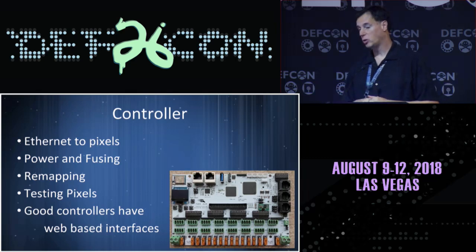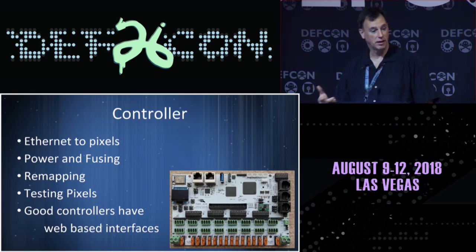Along the bottom, the gold-yellow things are auto fuses. So each of the pixel strings is fused. They're DC elements, usually running 5 volts or 12 volts. And sometimes bad things happen with water and power. So having fuses there matters: I've seen cases where people have shorted, gotten to the point where they've melted elements or even started small fires when they haven't had fusing. And the best projects have fusing within them as well.